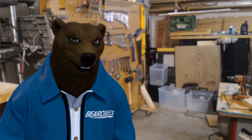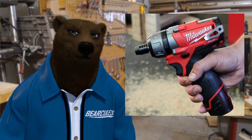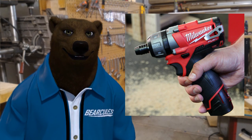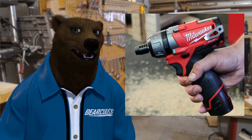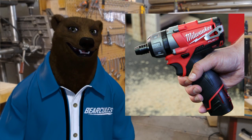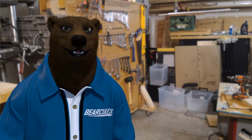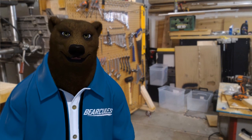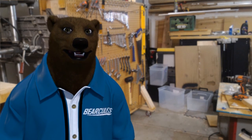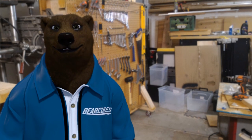And what that means is by going to these larger batteries, they won't be able to fit those battery packs. I think there's 3 of them currently in the handle now. And to be honest, they've even had to stretch the handle. And I'm talking about the Milwaukee and such here. They've had to stretch that handle to the limits of comfort to fit that battery pack in there as it is. So they'd either be forced to stick with 18650s, put only 2 of the 21700s, which would not be more power than 3 18650s, or switch to the pod kind of design like you see on the Hercules. And then, of course, if you do that, well, now you've got an uncomfortable handle with an external pod. So anyway, that's the reason why the Herc team decided to go with this.